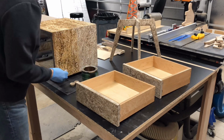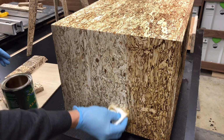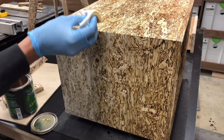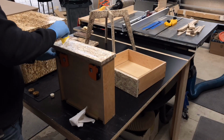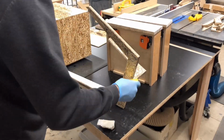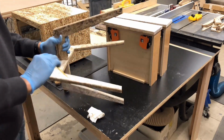Just like any other wood project, it's always best to sample the wood finish or stain that you intend on using on a scrap piece of hempwood or on a hidden area on the workpiece itself. It is recommended to use oil-based finishes and stains on hempwood since water-based could adversely affect the fibers in the hempwood.